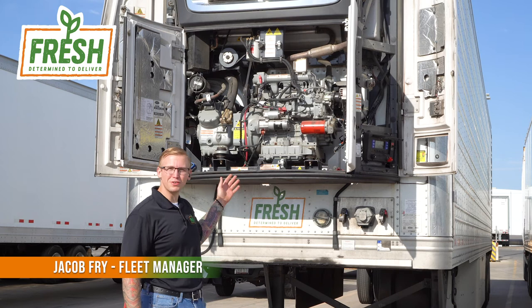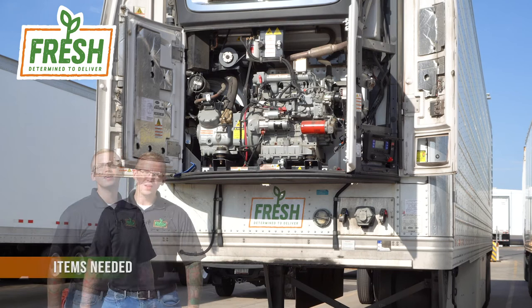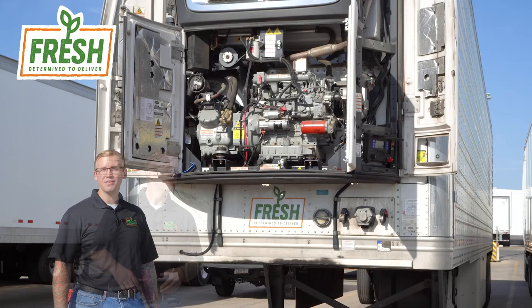You found our reefer service walkthrough. Today, we're going to give you a basic step-by-step guide to servicing a reefer unit. The tools needed, the items needed, and the steps can be found in PDF form on our website. The items needed will be an oil filter, an air filter, and a fuel filter. And of course, oil and fuel to prime the fuel filter, and oil to fill the unit when you're finished with the draining. Let's dive into it.